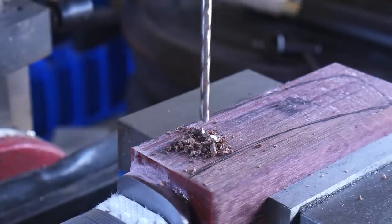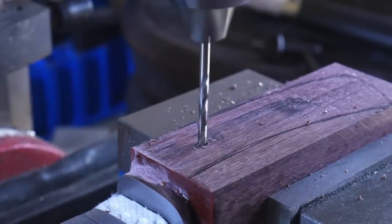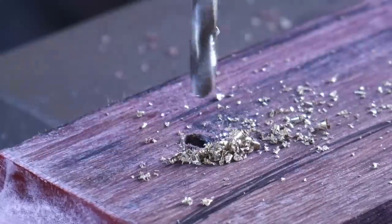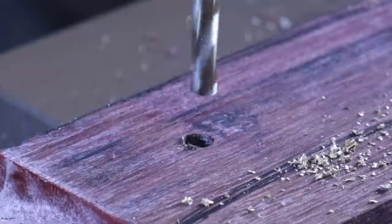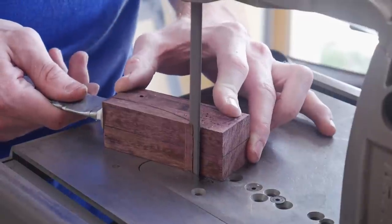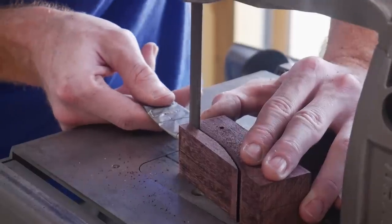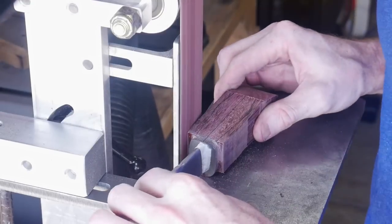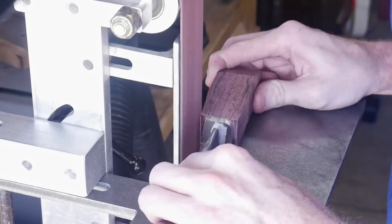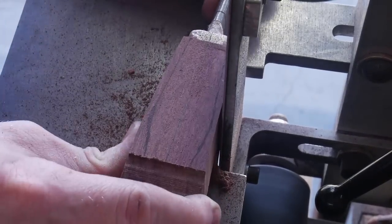Before we start grinding, I use that spotting drill again to spot where my pin hole will be, and then I drill an eighth-of-an-inch hole into my handle through the brass plug in the tang. You can see I started getting some brass back, which makes me happy — it means I definitely contacted that plug. My eighth-of-an-inch drill bit has a little bit of runout, so one side is ever so slightly larger than the other, and I compensate for that later by tapering the stainless steel pin so it has a nice tight fit on both sides.